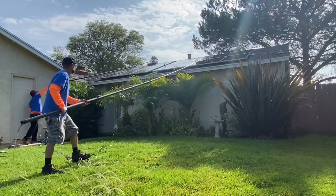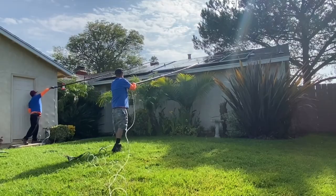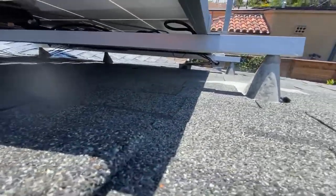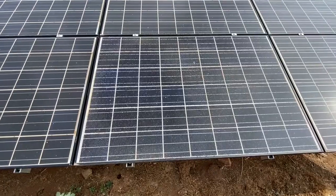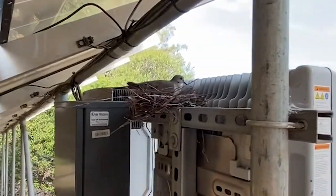I like to get two away photos and two up-close photos. While up on the roof and in front of the solar panel system, we like to perform a basic visual inspection of the solar panels, connections, brackets, etc. Basically, we look for any broken panels, any disconnected wires or cables, we look for any damage, and finally look underneath the panels for any bird nesting.